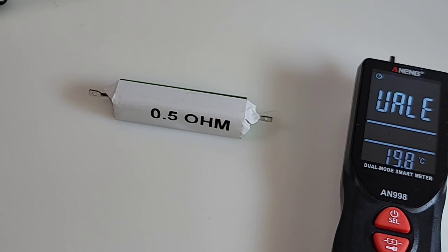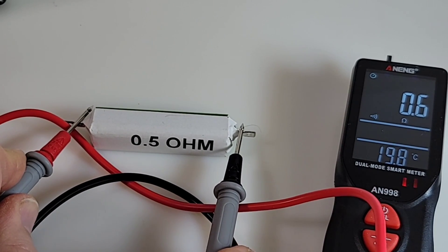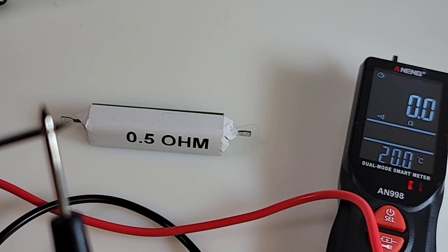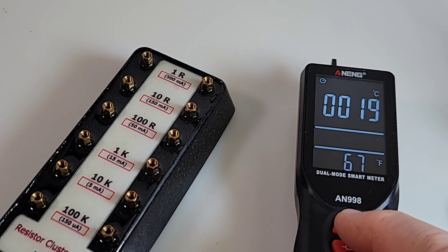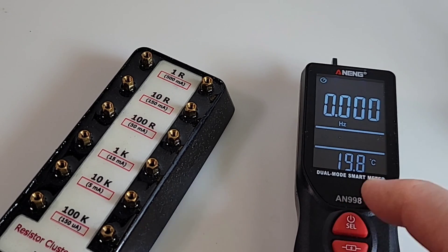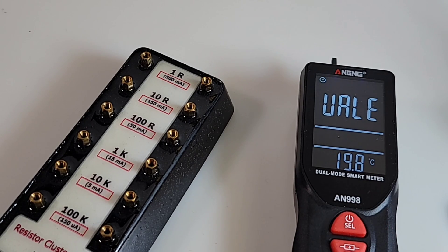Let's try accuracy - a low 0.5-ohm resistor. Can it even get down there? It does - 0.6 of an ohm. Putting those leads together - no resistance on the test leads, which is good. Note: in manual ranging mode, we have no option for resistance - so we are SOL on that count. Basically automatic only for voltage AC/DC as well as resistance.